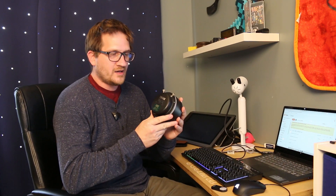In this video I'd like to do an objective measurement comparison between the two horns. I'm also going to look at a compression driver by Altec from the same era. For the horn measurements, I wanted to give the horn its best chance of performing well, so I decided to do all testing with the TAD TD-2001, which has the flattest response of any driver I've measured. I did that so nobody could argue the comparison isn't valid because the driver wasn't good — this eliminates that argument.